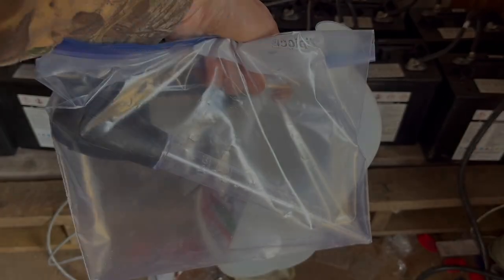Back to the longevity question — the battery banks I had as a kid in a much smaller scale solar system lasted, on average, about 10 years. You throw that number at anyone who thinks lead-acid batteries don't last very long and they'll tell you that's impossible. But it isn't impossible if you take care of them. Take care of your stuff and you won't have to buy it twice. All done until next time.